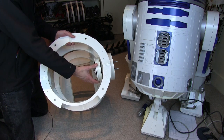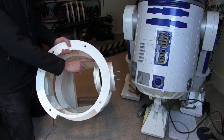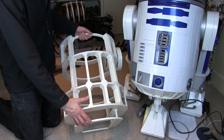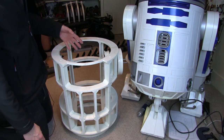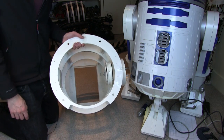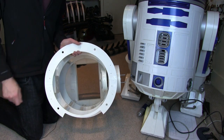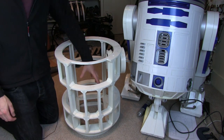I've got one shoulder hub fitted so far - I haven't put the parts on for the other one which are currently printing. Before I fit the motor to motorize that, which is going to go somewhere at the back here, I need a pair of them and I'm quite cautious about preserving the space for the center foot retracting mechanism. On this droid the center foot is fixed, but on this one it's actually going to get sucked up inside the body. That foot and its leg need to fit inside the body, and when it's retracted it almost reaches the top of the droid, so it's going to come in between the two shoulder hubs. The next thing is doing a bit of design on that center foot retracting mechanism, then we can sort out putting all three motors on for the two shoulder hubs and that center foot rail system.